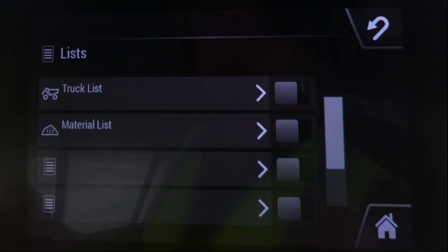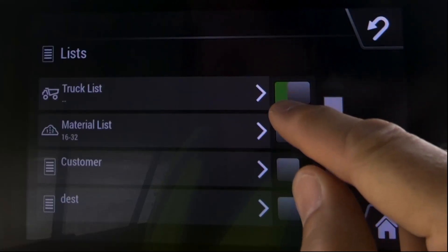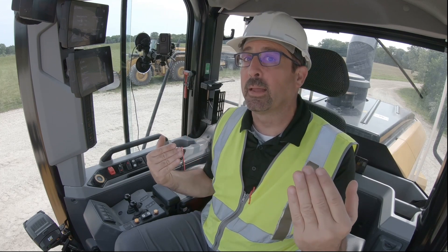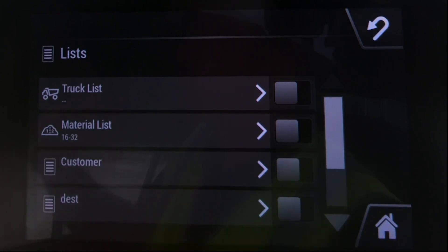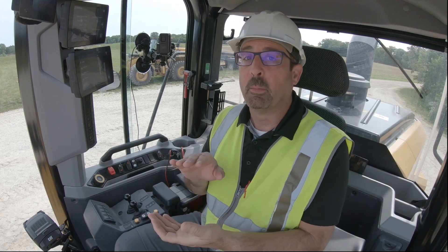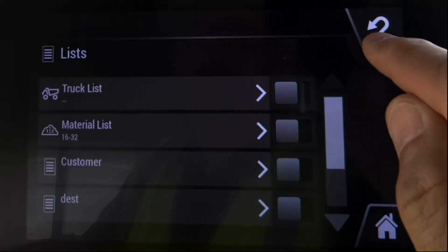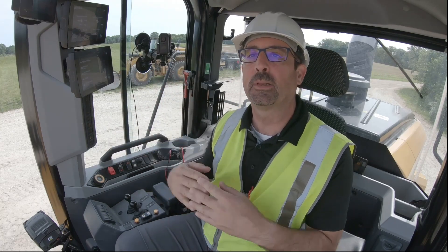Under lists — what are lists all about? You've got a truck list, a material list, and four custom lists. You can turn those lists on or off here; if they are turned off they don't show up on the top display and convolute that primary display for you. But if you want to use a truck list, a material list, or four custom IDs that you program yourself, you can track data like how much material you're moving into a hopper or how much material you're sending out with each of your customers. You can track that here and retrieve it through the list management feature set. With auto truck ID and auto material ID turned on, every time you press store it takes you to that list management select so you can select the next truck or next material you're going to load out.